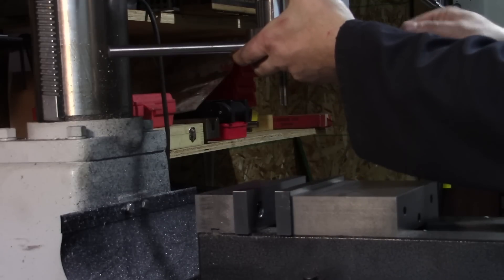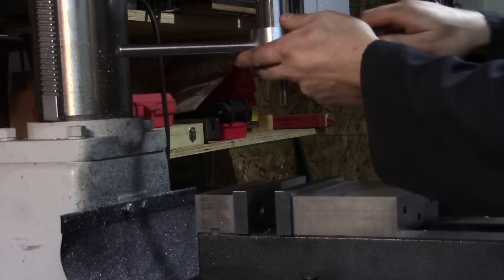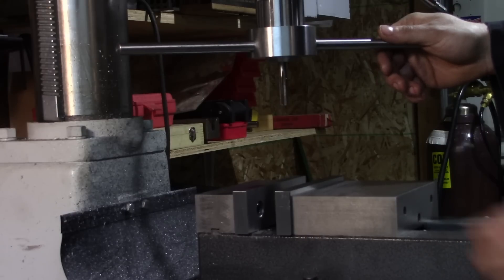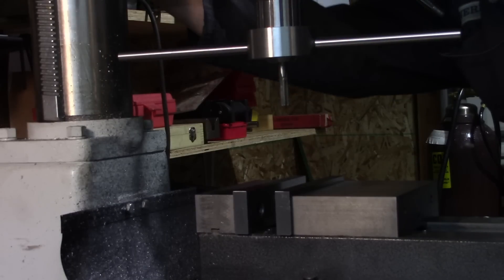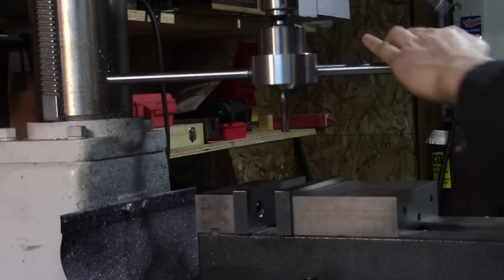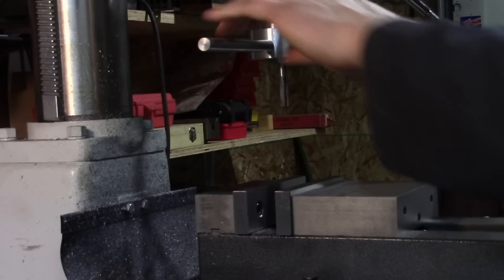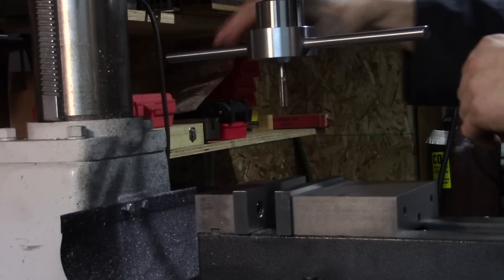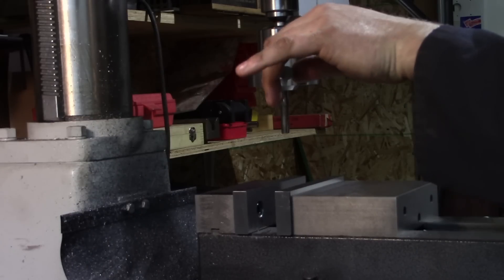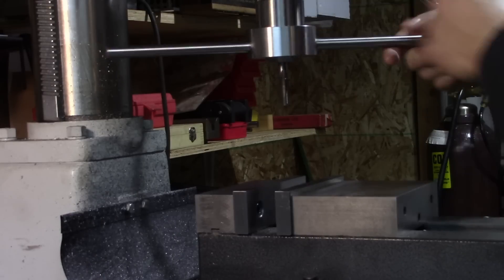It's our drill chuck tap handle. Fixed handle over here — I can tighten up the movable handle. A little bit of play in there, that's okay. I mean, I don't want it to be too tight either. But now I can take the tension off of the quill and use that for actually applying downward pressure and getting my tap started straight. For smaller taps this is actually going to be ideal, because it gives me a fair amount of feel with the handles as to what I have for resistance on the tap, and then it keeps it nice and straight and rigid. I think this is going to be a very handy little addition to the tool kit.